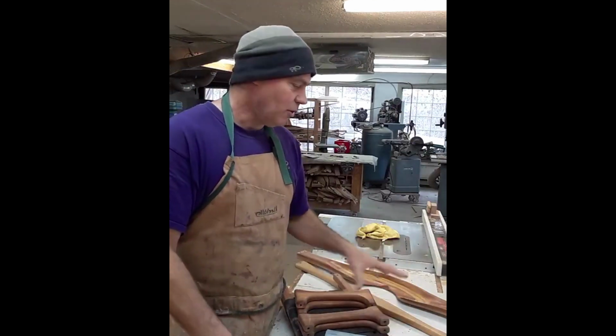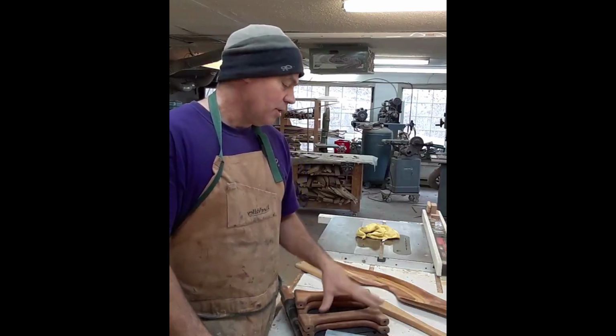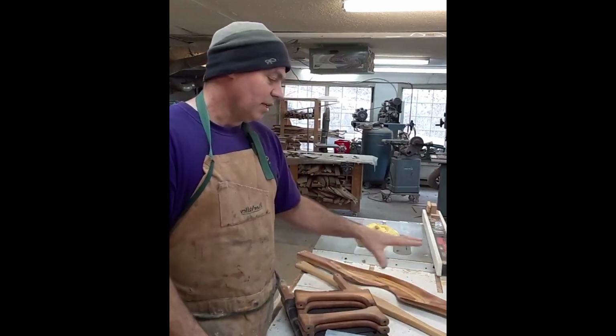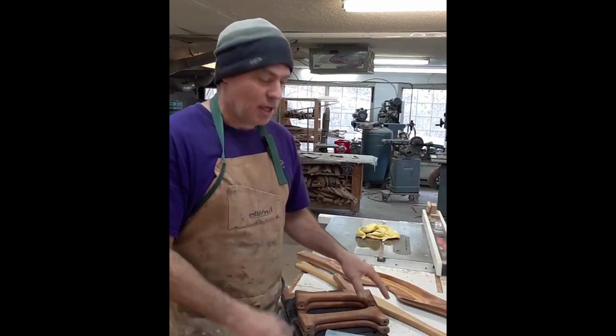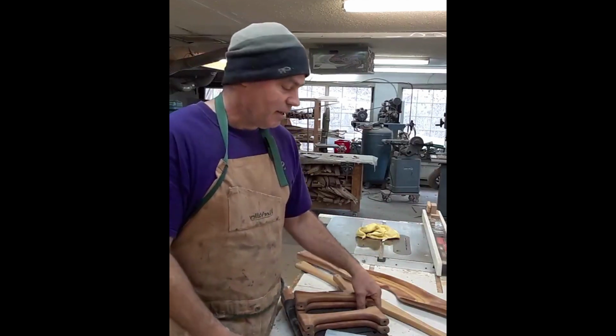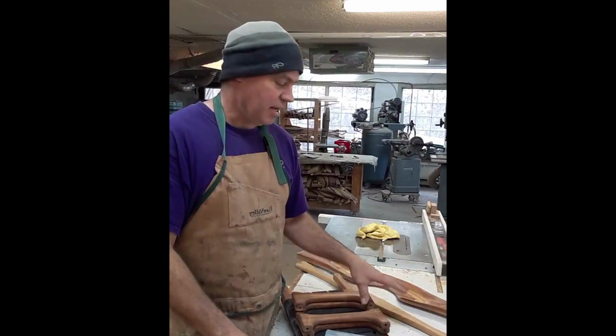So I use the tung oil on pretty much all canoe parts. I'll go and do those and get that all cleaned up as well. Probably 2 or 3 coats of oil on top of a light sand will do it with these. Could I go 6 coats? Sure, it would make it beautiful, but I think by 2 or 3 coats it's going to start to really shine up, because they're already well protected and not in too bad condition right now.